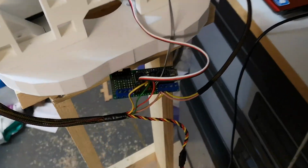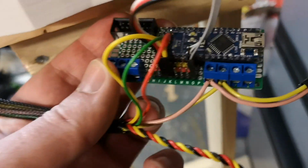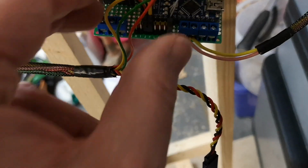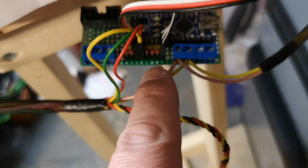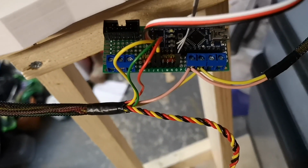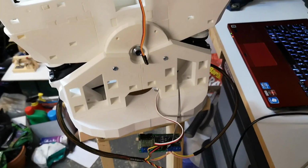And I was just having a look down here at where I've got this connected onto the board, and I've realised that I've connected one back to front. The yellow wire that we can see here should be on the other side, and the green wire, which is sort of to the back, that's the darker colour, so that should be on the outside, on the black rail of these connections. So that's back to front, so that's probably what the problem is. So I'll just move that around. So I swapped that over, corrected that little mistake there, and that now seems to be working.